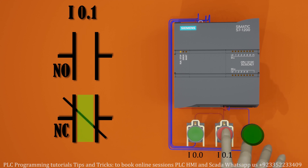But when we press the red push button, the PLC input i0.1 turns off, the normal open contact in the PLC opens, and the normal close contact closes. When we release the push button, the PLC input i0.1 turns on again and the contacts of the i0.1 input in the PLC program go back to their normal condition.